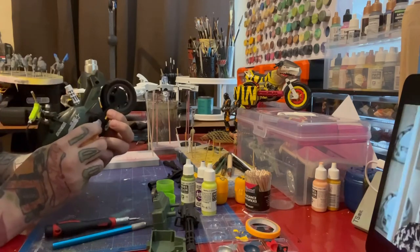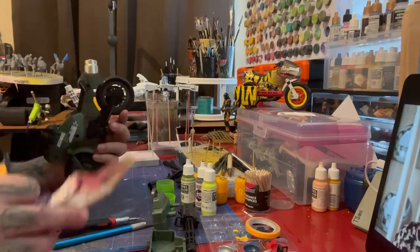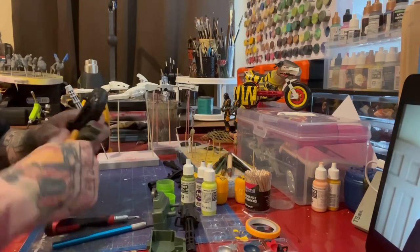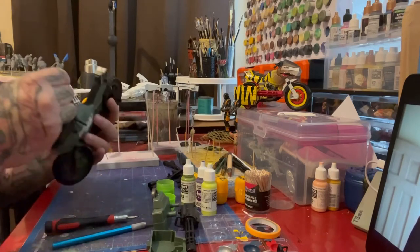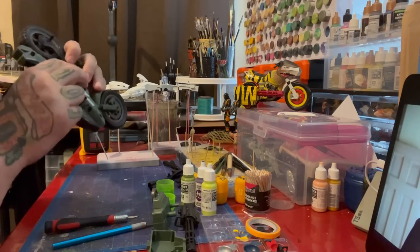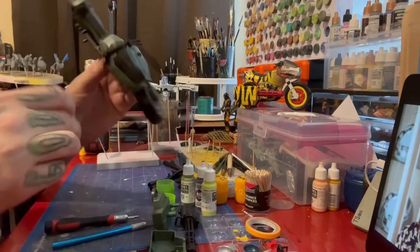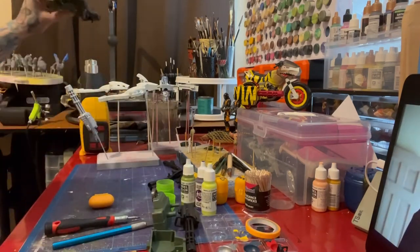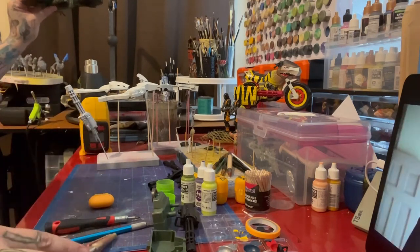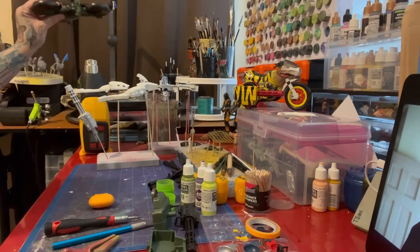What you're going to do is create space for the heads of these to be able to be pulled out. I'll show you what I'm talking about in just a second, once we create enough. Because if you keep pulling on this and pulling on this, it's going to be all out of whack. As you can see, it's creating space where the head of this is exposed. So you want to keep doing that until you have enough of the head exposed so you can grab onto it with these vice grips, and then you'll have enough leverage to pull them all out without really destroying or marring anything.